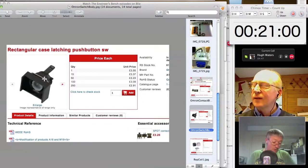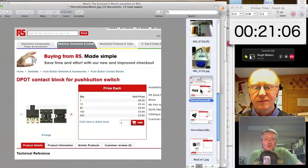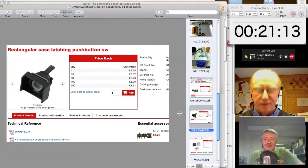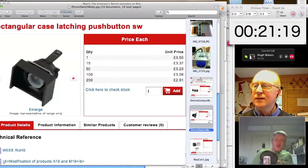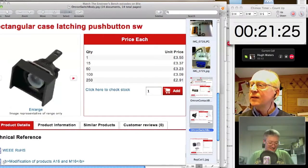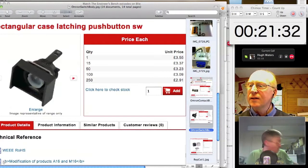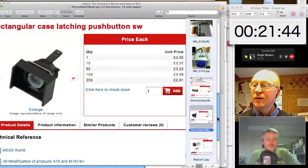The thing to note, which I always forget when I'm putting these parts lists together and buying these bits, is that with these switches, it's not the switch body that dictates whether it's a latching or a momentary switch. It's actually the piece that the switch connects to, which holds the lamp, which also holds the nice little coloured button piece. That's the bit that dictates whether it's a momentary switch or a latching switch. And of course, in some scenarios, for a cue light, you just want a momentary switch. In other scenarios, lighting a Mic Live light or the on-air light or whatever, you want a latching switch. So that's always worth bearing in mind. That's bit me in the backside on more than one occasion. It's worth knowing that. Yes.